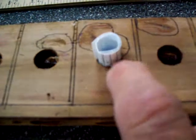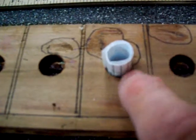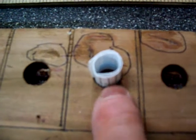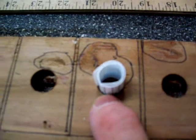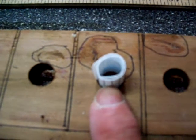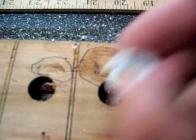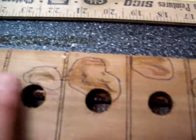It allows you to put the sealer right next to the hole without it dropping in. The sealer I use is auto body filler — it doesn't stick to that material because it's nylon. After that, all you do is jiggle it, remove it, and then just sand flush.